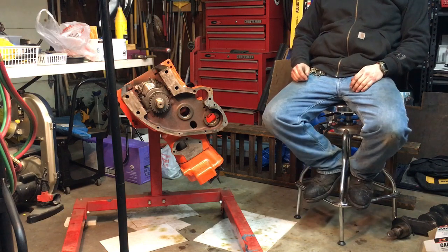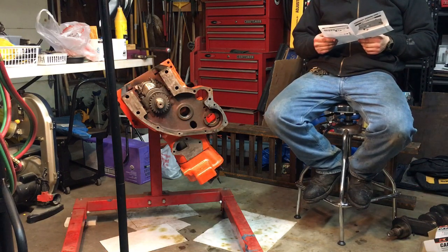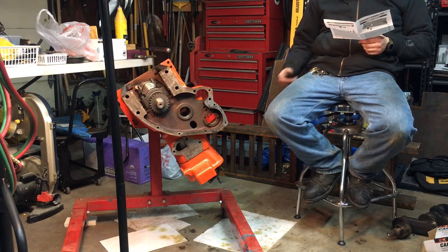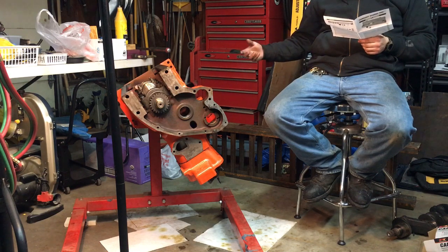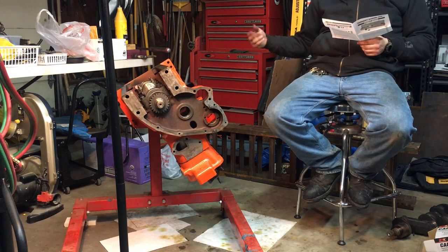So, we damaged one bearing. We drove it back out. We got the other one in. It got damaged somehow. And I followed the directions. It says with the nylon centering cone at the end of the first housing, drive the bearing into place. Repeat this step until the bearing is driven except the front or first bearing. To drive the number one bearing in, you need to move to the rear of the engine. So I started up here, I drove that one, that didn't work. Screwed that bearing up.